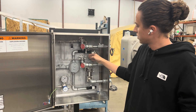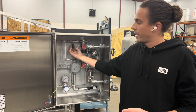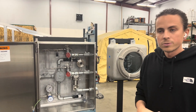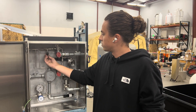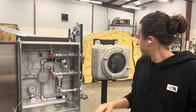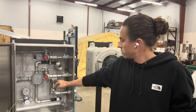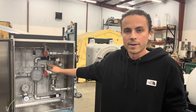We have two different flow paths. The first is a restricted flow path, meaning you can control how much odorant you want to flow through it, and then you have an unrestricted flow path. For lower flows — meaning thousands of cubic feet an hour — you can use this metering valve to set the volumetric flow being delivered to the pipeline. The PLC will always open the first solenoid and, depending on how much volumetric flow it's seeing from the flow meter, will adjust and open the high flow path solenoid when needed.